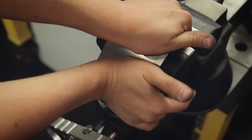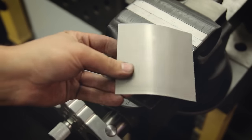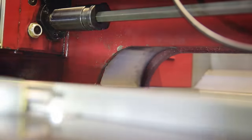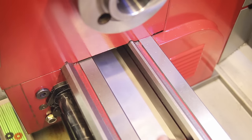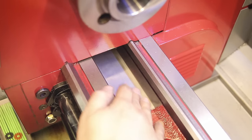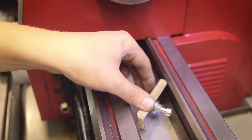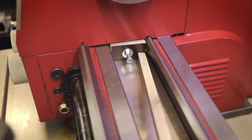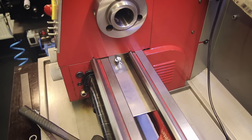For the bottom I just got a piece of aluminum sheet and bent that to roughly match the shape of the casting down there, and then I just jammed it in there tight so it can't fall out. This opening is fixed now, and for the top I cut another piece of sheet metal that fits between the bedways to plug up this big hole. Then I made this little thing from some plywood and chamfered the edges so it can be wedged in there, and the screw in the middle is just so I've got something to grab onto if I need to get it out again. These few pretty simple steps have made the cleanup a lot easier.